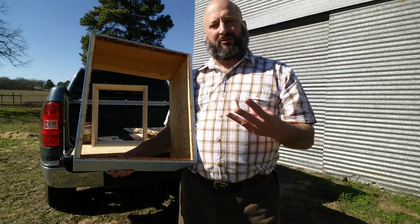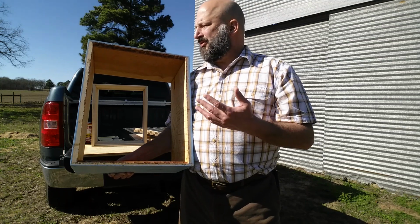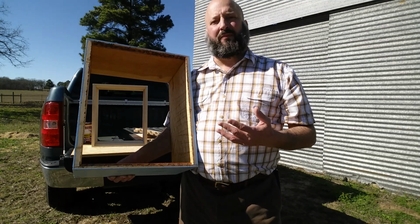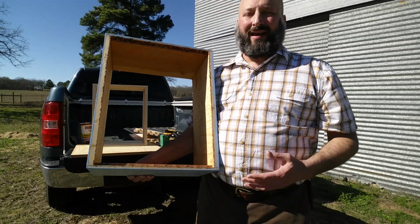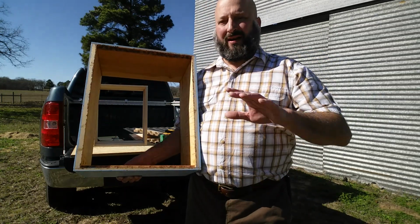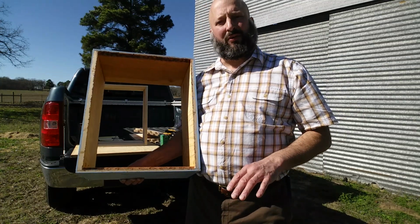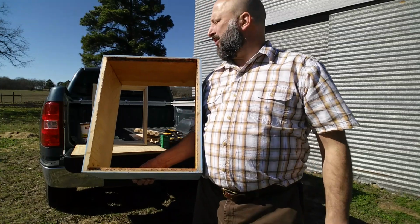One coat of primer and two coats of paint. Now, I buy a pretty decent paint, so it has a built-in primer, so I just use three coats of that. Unless I'm recoating something else that has mold on it, then I'll sand that down, and then I'll apply a mold-killing primer, and then I'll recoat it.